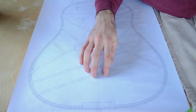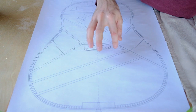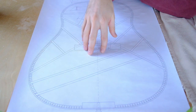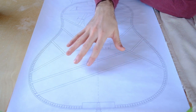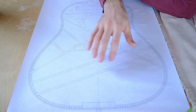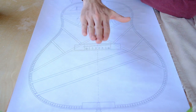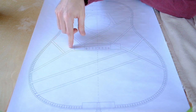I would say these braces are more influential in the sound of the guitar than most of the others. Some variations include another X, a couple of X's, or straight across. All the different variations sound a little bit different mainly because they are either more flexible or more rigid, but also the orientation of the braces affects how the top vibrates. There's the monopole mode of vibration where your whole top moves in and out, your cross dipole where the top is rotating, basically pivoting on the bridge, and then your long dipole. The orientation of these braces affects that, as well as whether the braces are scalloped or not.